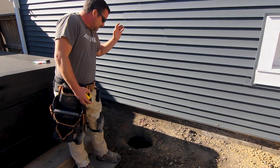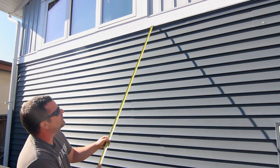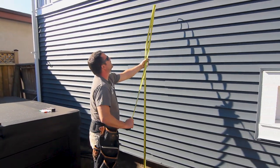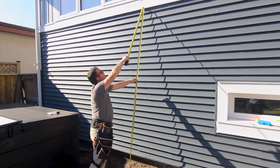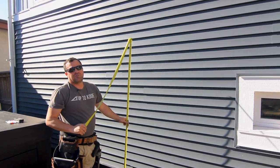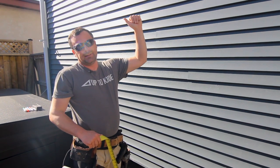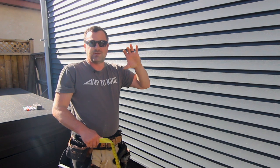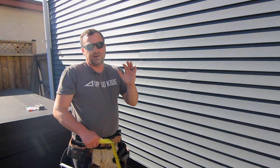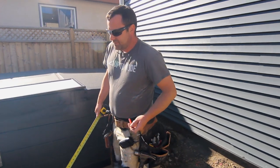This hole is four feet deep. The homeowner wanted six by sixes in the ground — it'll be a lot easier and better to do. We want the top of the pergola at the bottom of this belly band. When I estimated my materials, I just stuck the old tape down in there and I have 13 feet. I'll probably cut those to 14 feet, leave them a little bit long, and then cut them after. That way I can level it all in. These are modern pergolas — they want them nice, lineal, sleek, and clean, all deadly level.